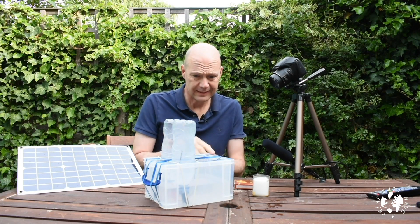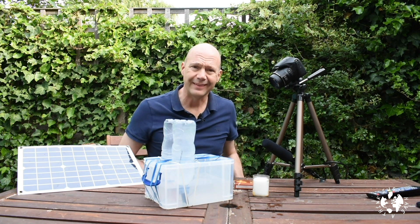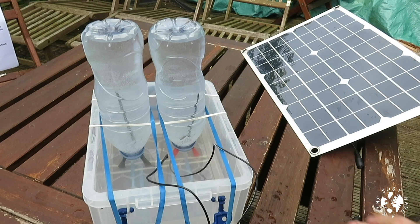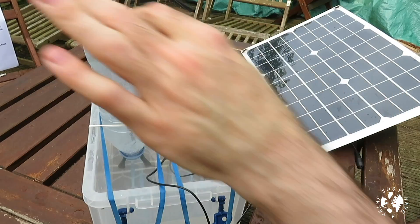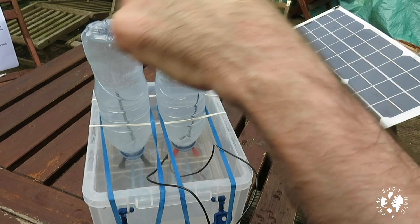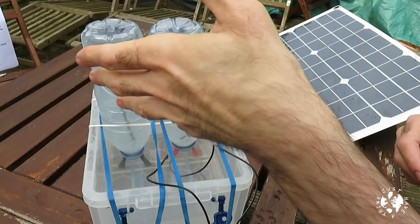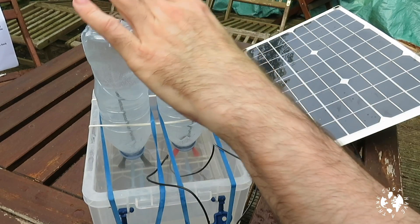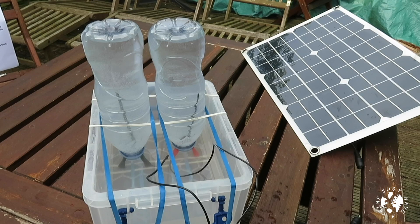So that's the electrodes into the water bottles in our solution. Now in theory, as soon as I plug this wire into the solar panel we should start seeing gases bubbling up into those bottles — hopefully twice as fast in this one, which is the negative electrode, than in this one, because there are two hydrogen atoms for every oxygen atom in water. So twice as many ions or electrons are going to be going into this bottle.